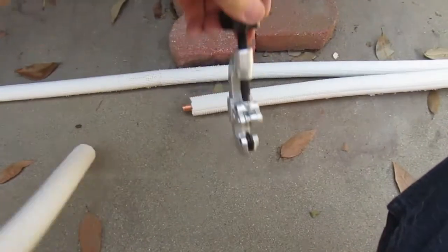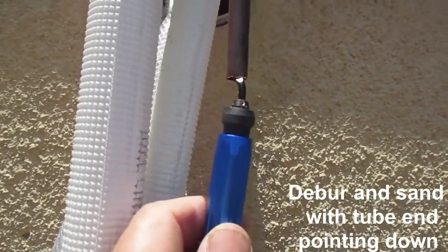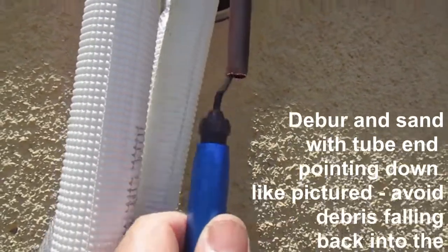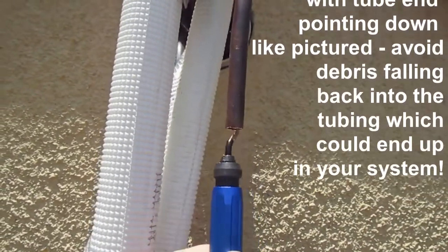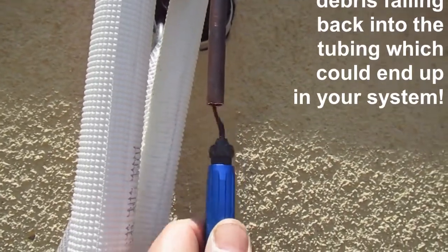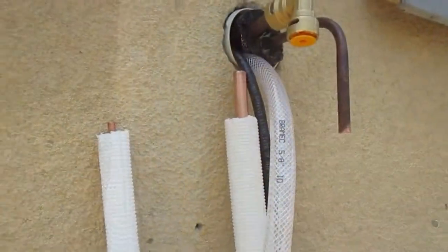Make a few swivels around the tubing and you'll have a nice cut. After you cut your tubing, you want to deburr it using a deburring tool — a fairly simple tool that fits on the end of the tubing. Go around and remove all the burrs and rough edges left after the cut. Now if you were brazing, you would also sand and clean up the inside and outside of the end of the tube.